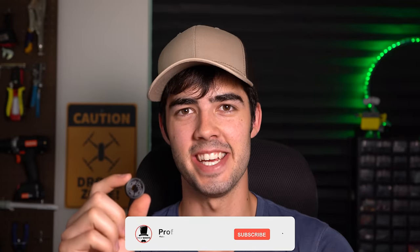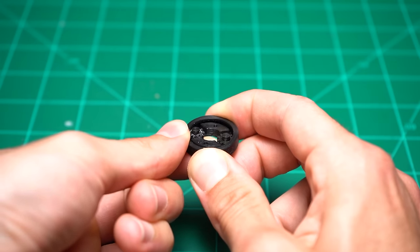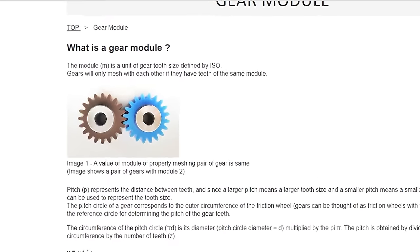The reason why it doesn't really work is because 10 teeth is the smallest number of teeth you can put on a gear in SOLIDWORKS — anything less is considered really bad practice, which is why I don't just manually make a 9-tooth gear. Because of this, I went with two planetary gears, each one having 10 teeth so that it could be tiny, resulting in it being unstable and liking to wobble more than a little. If you're unfamiliar with how to make a planetary gearbox: essentially the number of teeth on the ring gear and sun gear have to be added together and then evenly divisible by the number of planetary gears. 30 teeth on the ring gear, 10 teeth on the sun gear added together gives us 40, which is evenly divisible by two planetary gears, being 20. Now you may be asking: why don't I just make the teeth smaller so I can fit more teeth and have three planetary gears? The answer is that 0.7 module — essentially the size of the teeth — is as small as I can go on my current 3D printer. Which got me thinking: why in the heck am I trying to make this a planetary gearbox in the first place? Keep it simple, stupid.